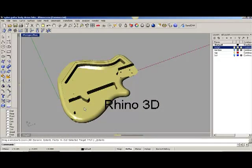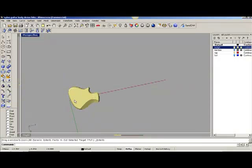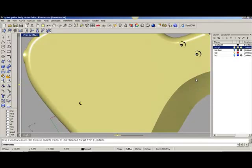What we want to do is actually design a plate for this. In this case, I'm going to use a half-inch aluminum plate that's about 12 inches wide, and I'm going to create a nice little vacuum fixture for this. One thing to remember is that we want to have some sort of indexing, and in this case I'm going to use these two pins or these two holes which I'm going to create.